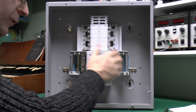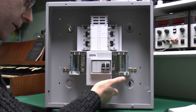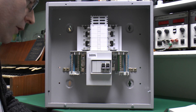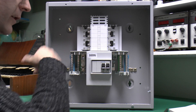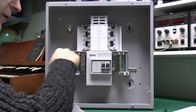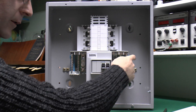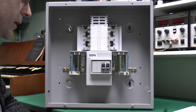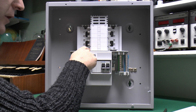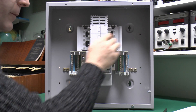So that's now assembled. This is all covered so that when the switch is in the off position, you don't have any exposed metal parts inside — your live cables coming in the bottom would still be connected. We're not going to be putting any outgoing devices in at the moment. But you just attach those in horizontally here and over this side, then the neutrals connect to the bars here and over that side for the circuits. They fit in much the same way as a consumer unit — they simply slide over the tabs here, with the bottom secured with a screw and the back hooking around this rail here.